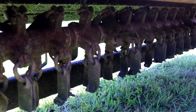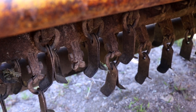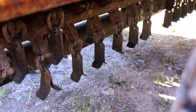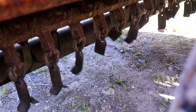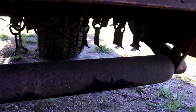These are the cutting knives or flails for this mower. A giant shaft rotates, and the flails come down and whip the grass and vegetation below — that's the cutting action. Since these are lightweight flails instead of giant blades, if they hit an obstruction they just deflect off, making it less likely to break the cutting knives or send debris launching from the mower.